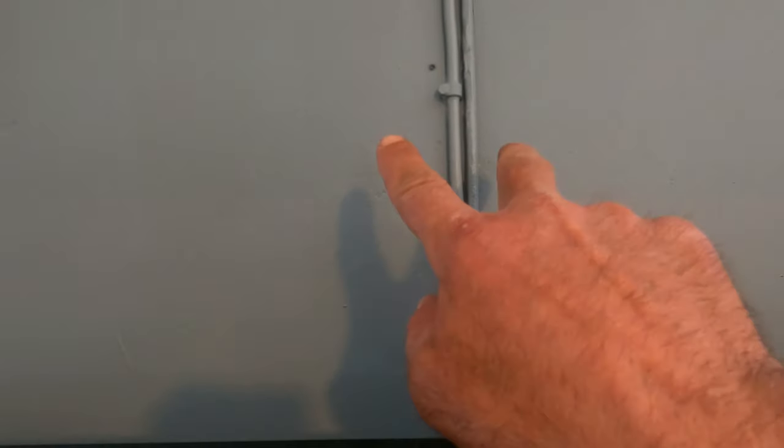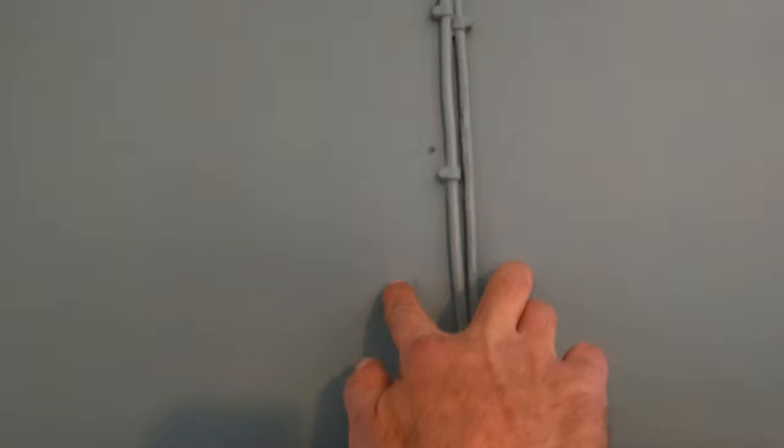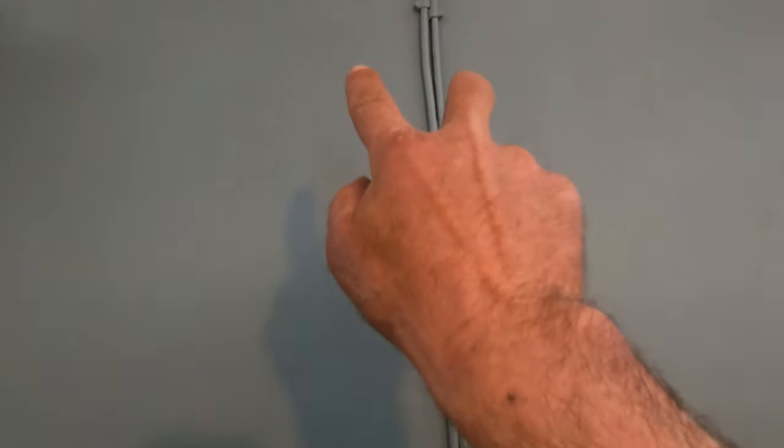Yeah, so I've got a nice TV on the wall there, but them wires need to go. And what I'm going to show you is how to chase out the plaster and the brickwork. I'll make a channel up there like that and chop out the plaster, chop out the brickwork, get it back enough to hide those cables in there. And then what I'll do is re-plaster and finish off the surface of that with a fine fill, and then repaint as well.